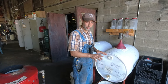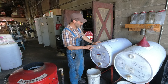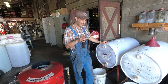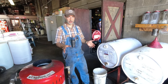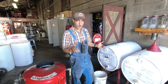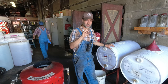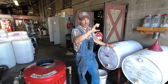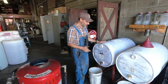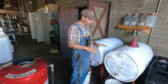This other product is Scale-Gone, a scale scavenger that helps with TDS levels. It doesn't get rid of the solids — what it does is suspend them so they don't stick onto the sheets or the fire box, especially the crown sheet. Without this, over time all that scale, calcium, and gunk would fuse to the sheets — particularly the top of the crown sheet — creating insulation. With fire on the other side, more insulation means you need a hotter fire to produce the same amount of steam. This product minimizes that adhesion, keeps the scale in suspension, and combined with blow down, helps maintain the boiler.